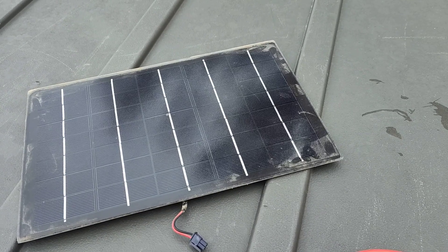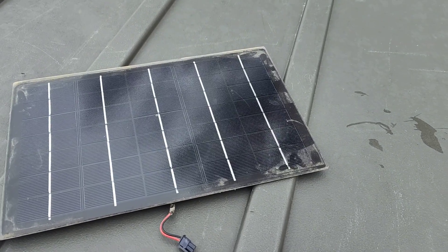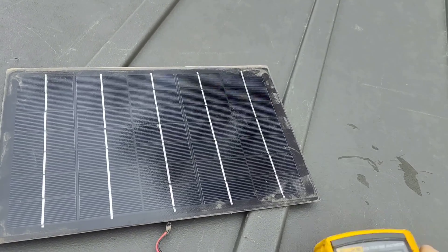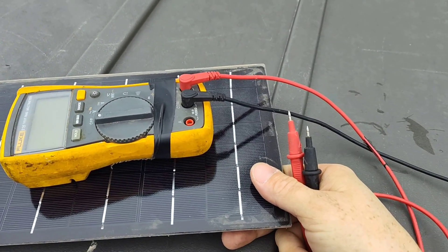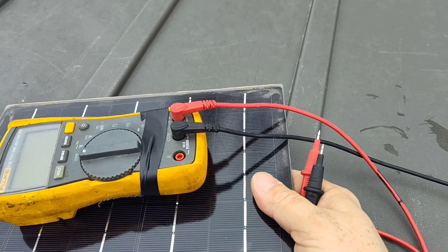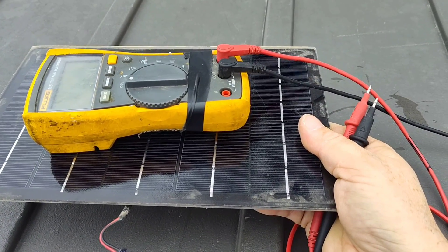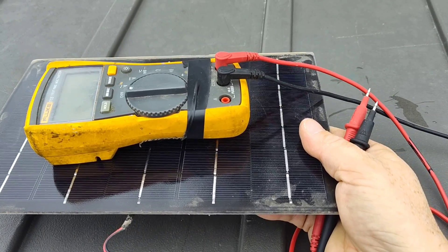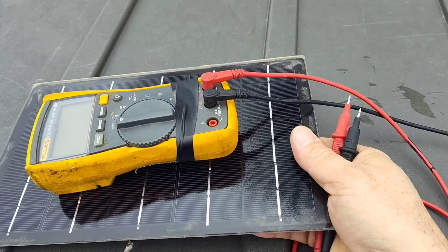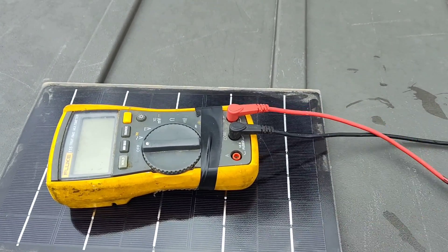So we've got a circuit board problem. I need to see if I have a board in stock. There's not much repair work we can do to these boards — no schematics available, and they're all surface-mount components. The unit is a 500-dollar fence charger, maybe 450, and the boards are less than 200 from Gallagher. We'll look at the board and check if I have one in stock.